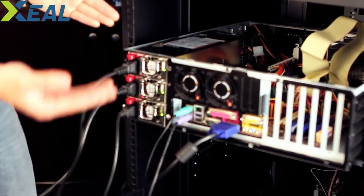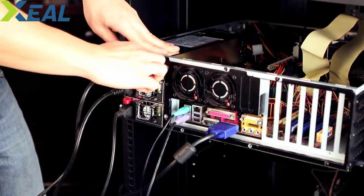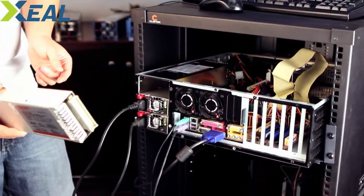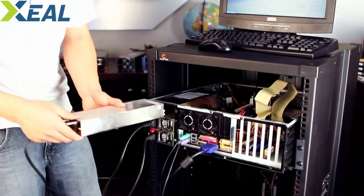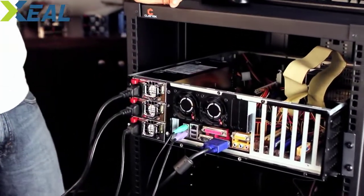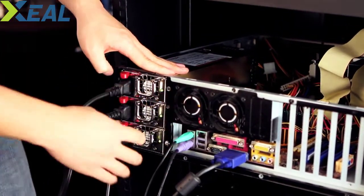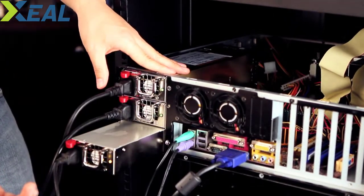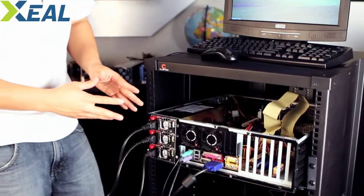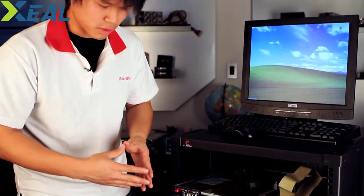Let's say one of them fails — you'll get a notice and the power supply will beep. All you have to do is pull out the bad module. The remaining modules share the load. Get the failed one replaced or repaired immediately. Once you get the new one back, plug it back in just like so, and you have full redundancy again — doesn't matter if it's the top, middle, or bottom one. This is a hot-swap redundant power supply, and with this in your system you can ensure your investment is protected, your clients are happy, and your users get zero downtime.